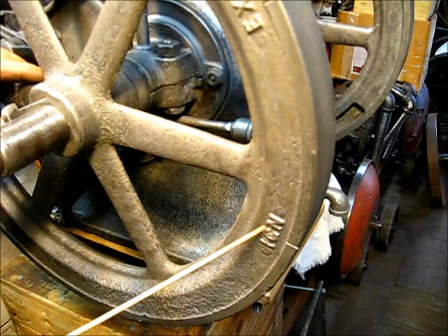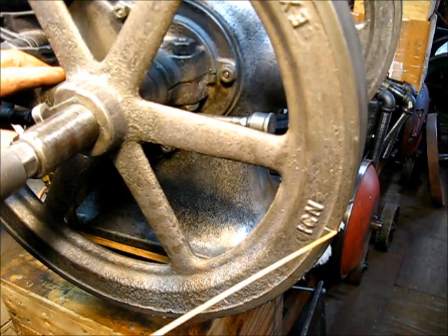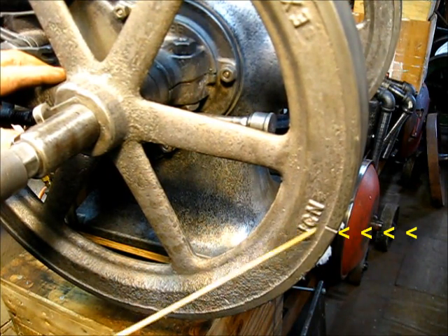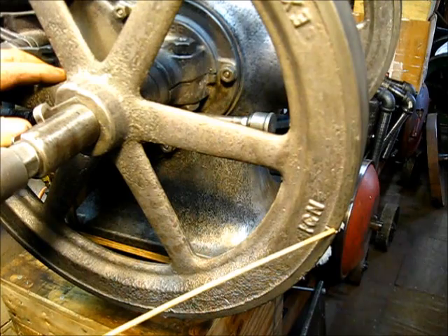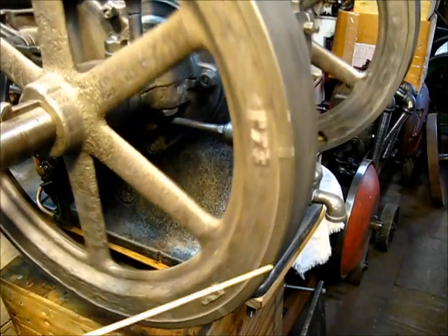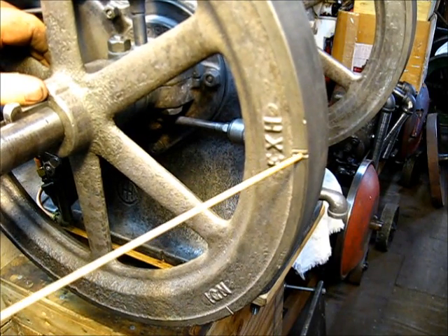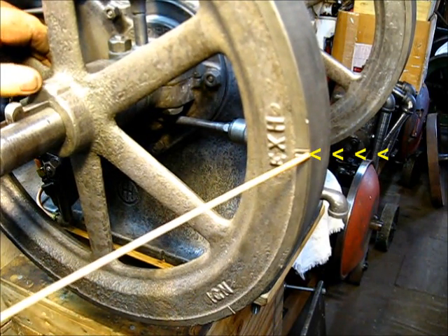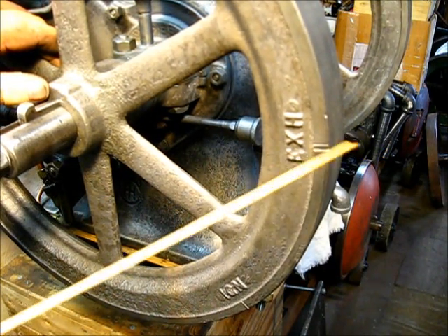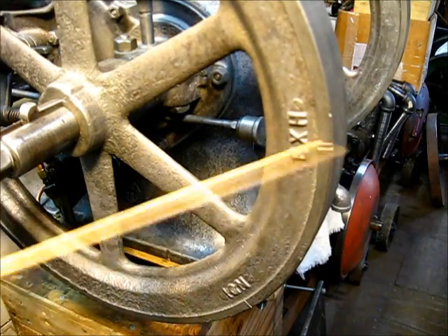Let's begin with the ignition mark. That's it right there — that little chisel mark in that flywheel where 'IGN' is cast in there. That's the ignition timing mark. We're not concerned with that at all at this point. The other mark is 'exhaust,' cast in the flywheel. This particular one has two chisel marks: a deep one and a little skinny one right beside it. It's been marked twice — that's factory. That's something that left the factory that way.